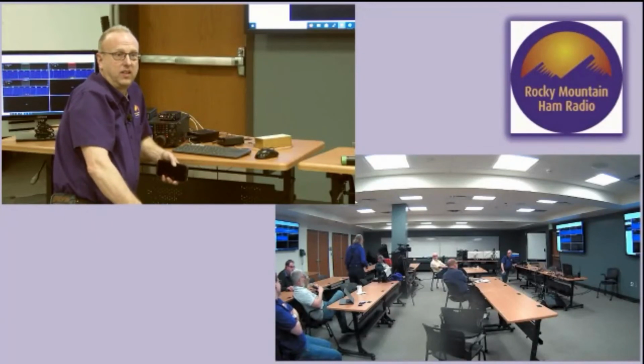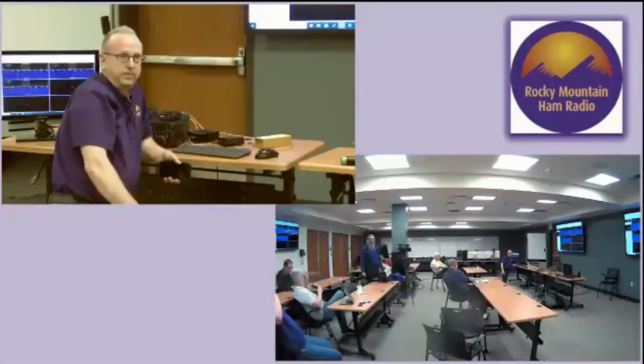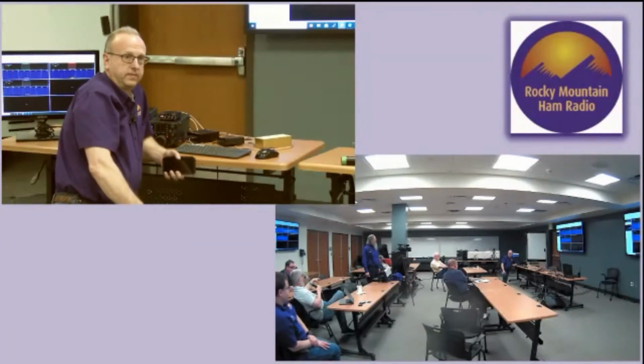Available at RMHAM Field Day? Yes, this will be at Field Day. And on 6 meters? Yes. So obviously your Pro 3 will work without a filter. But you would need that external filter to keep the SDR from overloading. Now, if there was another 6 meter station running, that filter wouldn't stand a chance.